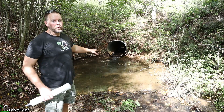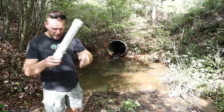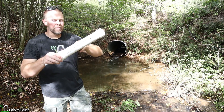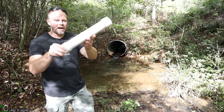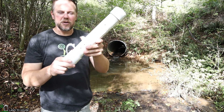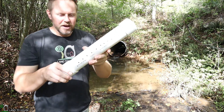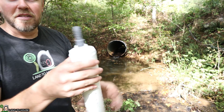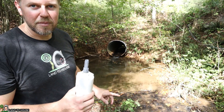Sometimes you can use a little torch to heat these up. For my source water, I have a great pool back here which is deep enough that I can put my intake into. Typically I like to use a three-inch pipe with a bunch of holes drilled into it and some window screen wrapped around it. I do not have any window screen, so I'm going to try a two-inch pipe today with a bunch of smaller holes drilled in. It would be ideal to have bigger holes and window screen to help keep debris out. It's just a two-inch pipe with a bunch of holes drilled in it, and on this side it has a half-inch barbed fitting that's going to go to the other end of my poly pipe.